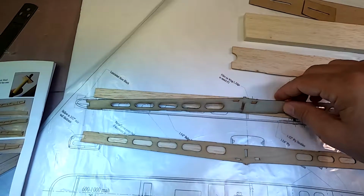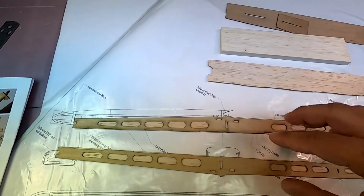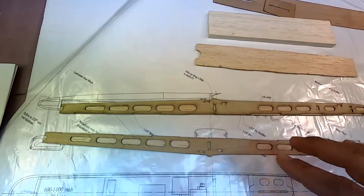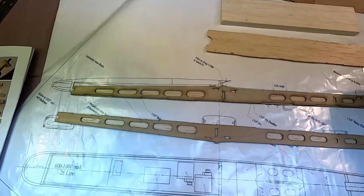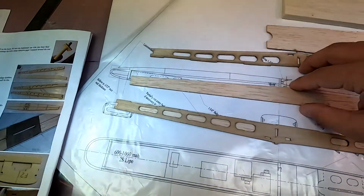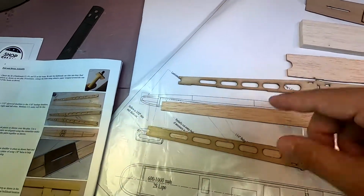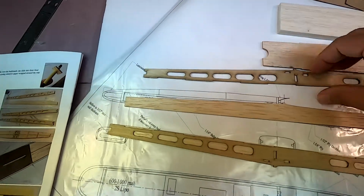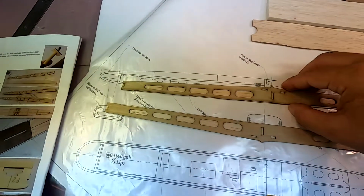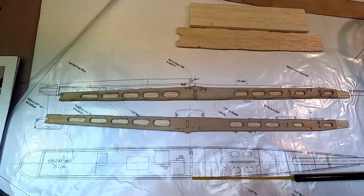And then I'm going to put them in place. I'm going to try to line them up as well as possible immediately, because even the slow is only going to allow so much movement because of the amount of surface area it's going to want to grip. So try to get it right as soon as you lay it down. What I may do is put some pins, not through the wood, but at the edges, probably pointing out at a slight angle, or at the very most straight down. That way I've got something to guide the doubler as I'm laying it in place, but I'm not sure if I'm going to do that or not. I'll talk about that later, if it becomes an issue, if I do that.